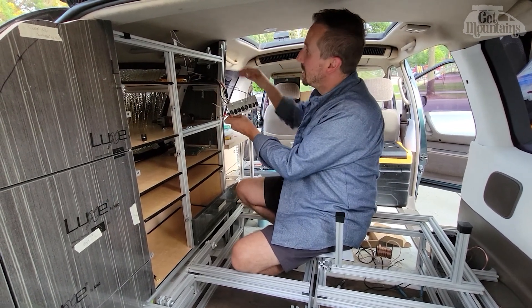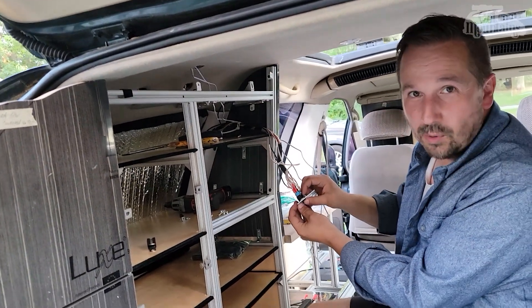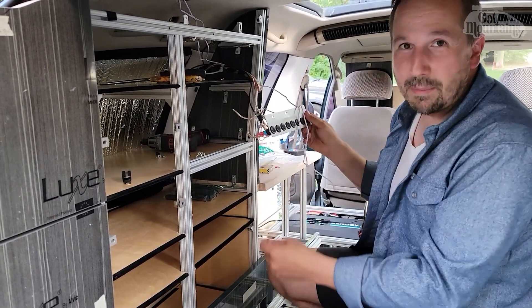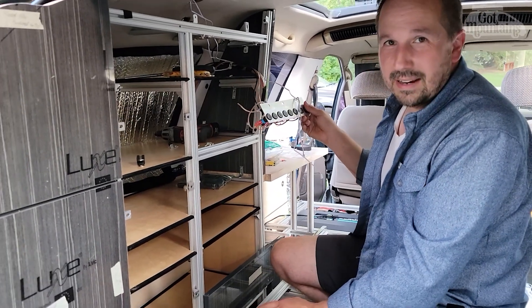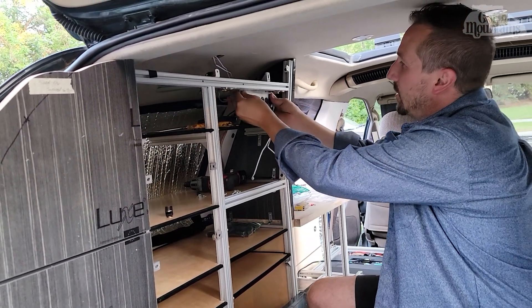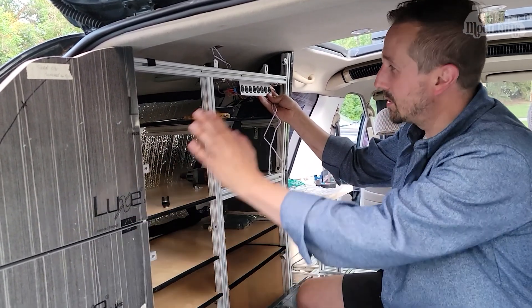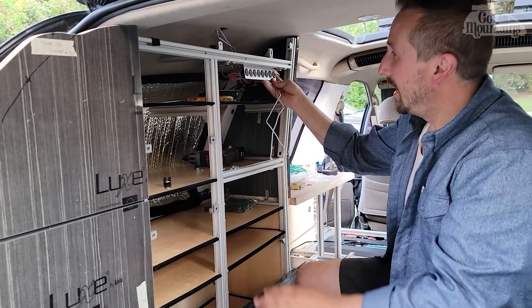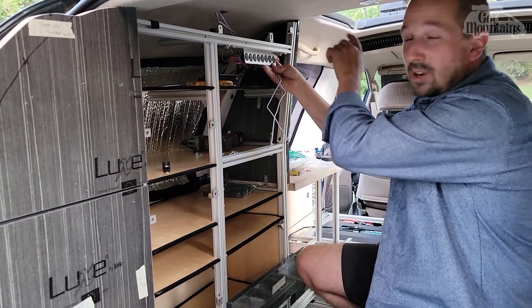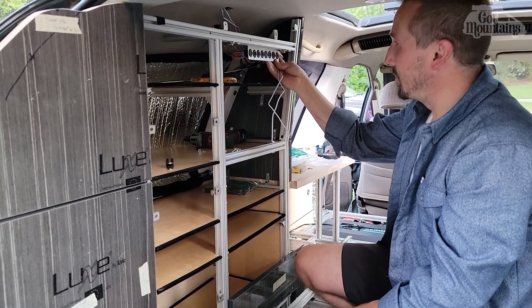One of the problems we had: we were going to put these buttons up in this panel here, but this panel is five-eighths thick and the threads on these buttons only go to about half an inch, so there's no room to thread on the other side. We thought about gluing them in place but didn't like that idea. So what I did is I made this aluminum plate which will sit up inside here and mount inside the cabinet - out of sight. Marilyn was complaining that she liked how the outside of the cabinets was totally clean with nothing interrupting it, and so she kind of got her way with this - mainly because we didn't have any other option.